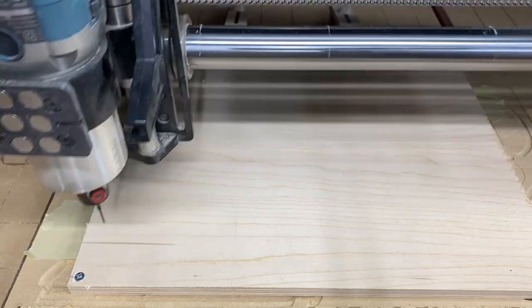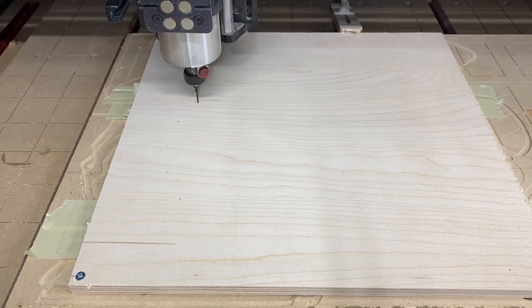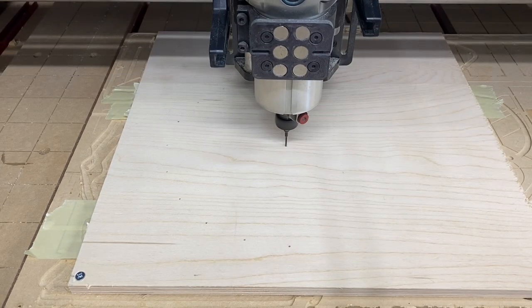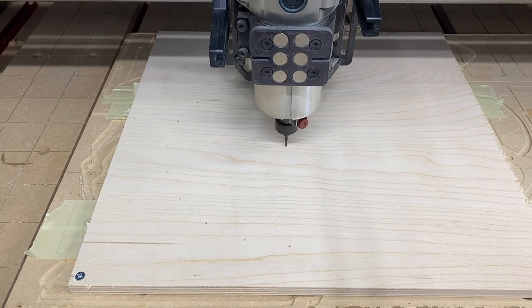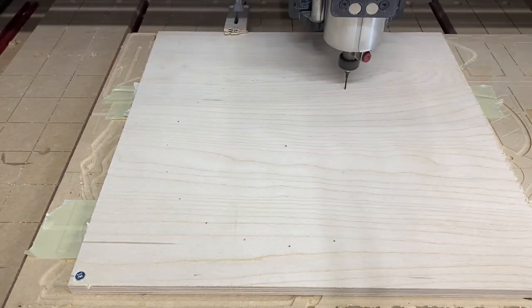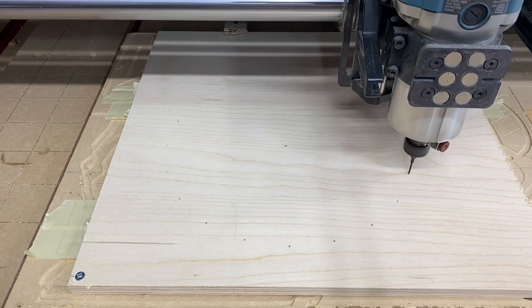The first file is absolutely critical — these are pilot holes done with a 1/16-inch bit. What these are going to do is ensure that when you drill on the drill press, they are exactly the same distance from the center. They must be the same distance or your wheel will skip a marble, or worse, one of those marbles can get jammed between the ramp and the wheel and stop the whole thing from turning.